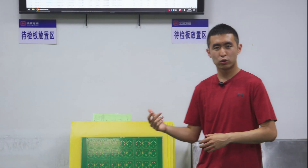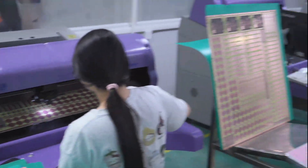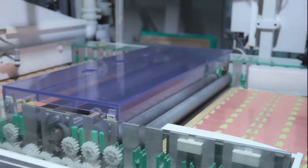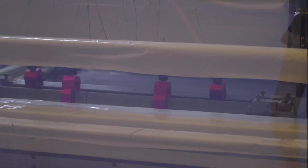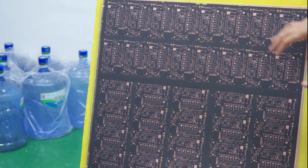Now I'm in the quality control room for the solder mask. I know I skipped some steps because this is finally a room that has some peace and quiet. I'll play some videos of the boards actually getting the solder mask applied. What happens is that the solder mask — it's liquid — and it's screen printed over the fully laminated board. And later, the pads that you want to solder to are etched away, leaving the rest of the copper covered.